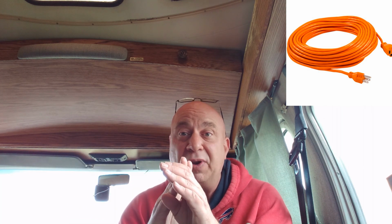If you have a 50 amp rig, you want to be able to step down to 30, and in a worst case situation, you want to be able to step down from 30 to 15. Again, so you're covered in any situation. If you have, just say you're out in a minivan or a little cargo van you've converted and all you have is 15 amp, you're just running the heavy duty orange extension cord to something, you want to be able to go from 15 to 30.